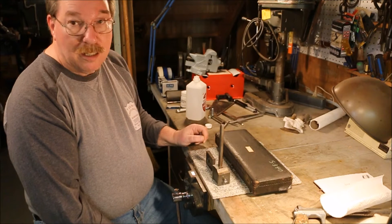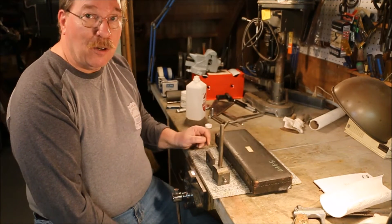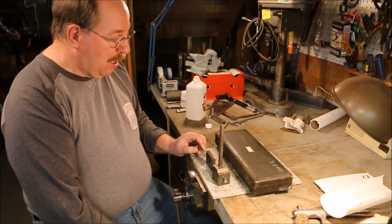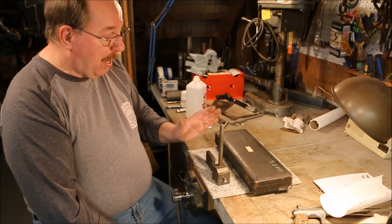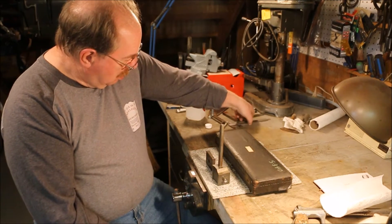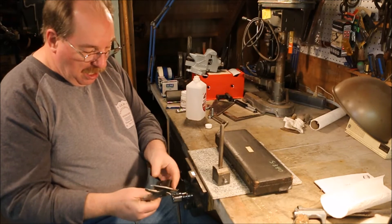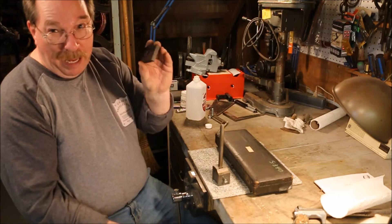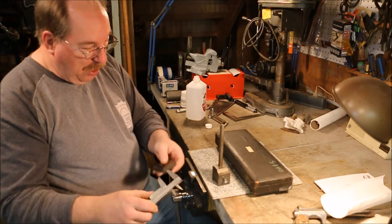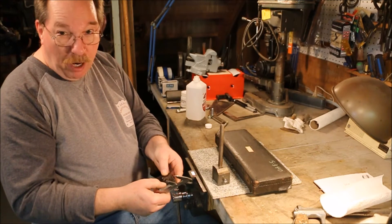In these days, digital CMMs can actually measure a block if you just set it on the table and hit a button — it'll go along, measure all the axes, and tell you what size it is and actually make a print of the part. This is kind of old-school, but when I first started this was actually a pretty cool way to do things. You could do it manually: take your calipers, lay out the block, and mark the lines on it with Dykem. This one's black oxided so I'm just using that instead of putting Dykem on it.